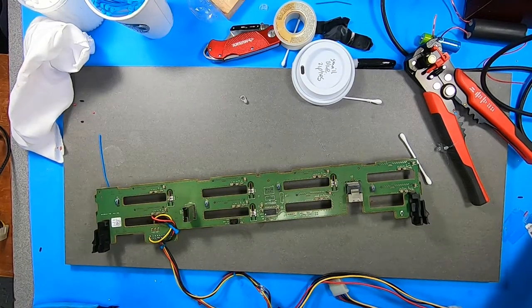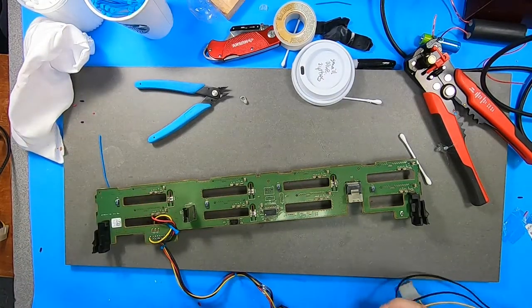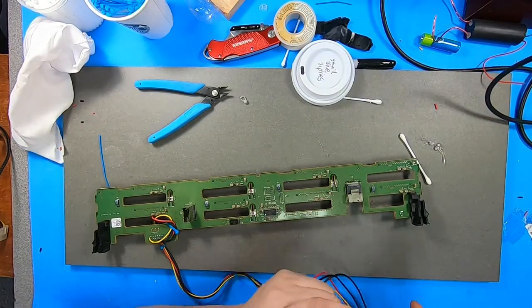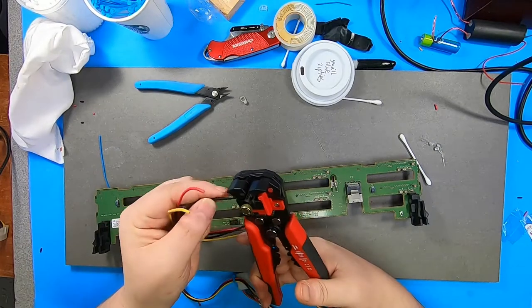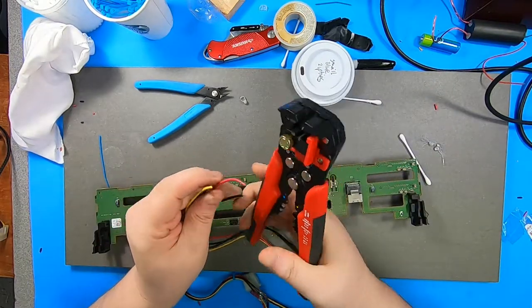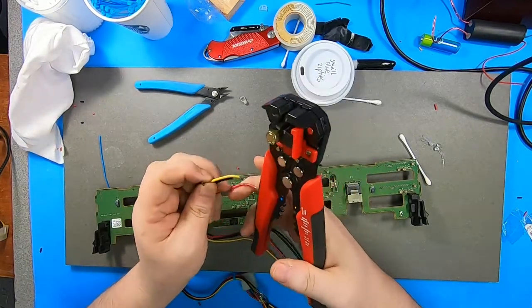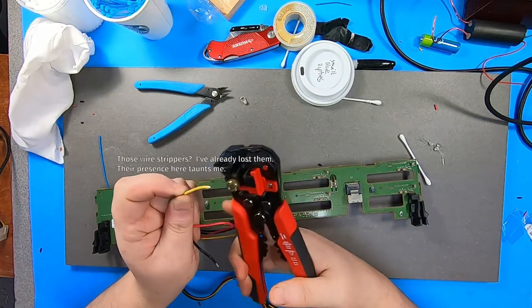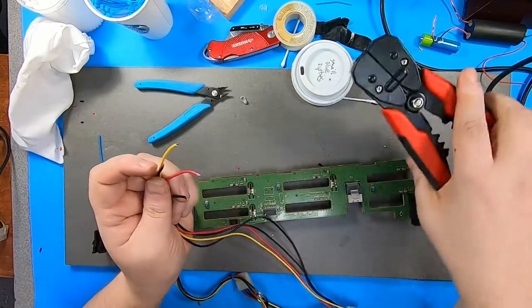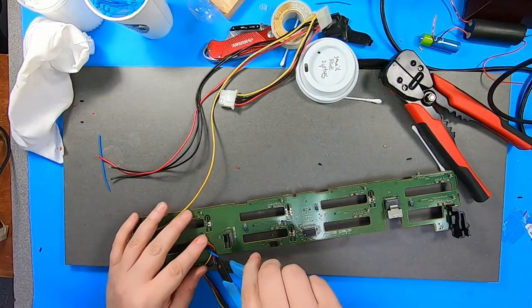All right, well, we're coming to the end of the project. And it turns out I do need to power that USB 3 thing externally, and either the sound card I have is crap, which is entirely possible, or the USB bus is bad. So to narrow it down a bit, soldering iron's ready, I'm going to power up that USB 3 card, which means I need to solder a regular Molex connector on, not just a SATA connector. So fun for me. More horrible, horrible modifications.